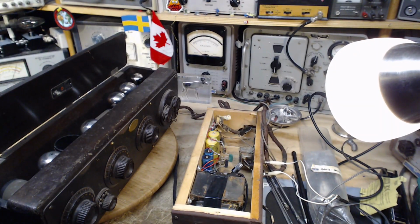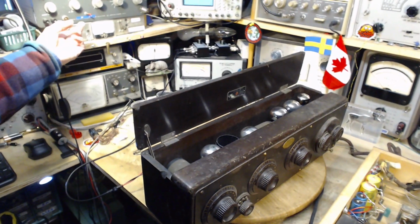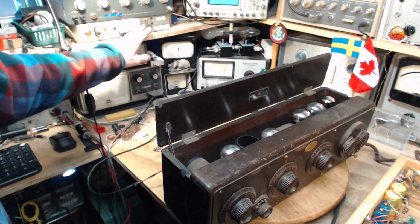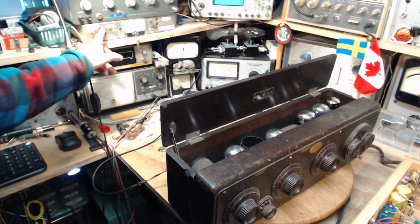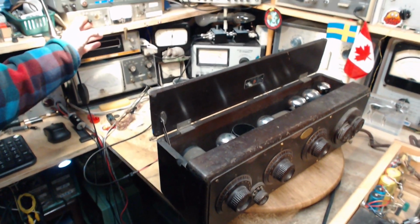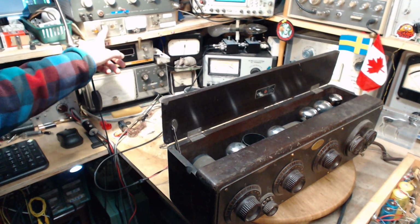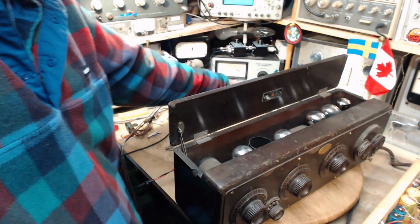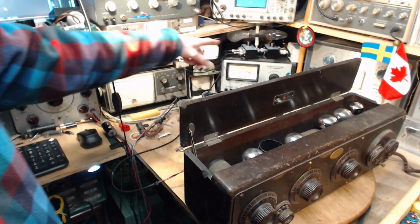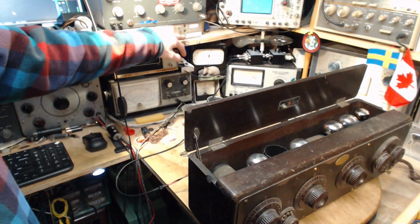Okay, so these switches on the panel here, with nothing plugged in, I'm going to operate them because they have a very characteristic sound. Hear that sound? So you hear that sound, you know I'm flipping one of these switches. This is the master switch, if you like, to just turn on this box. This box is nothing special, really. I had it, so that's why it's here. With this switch off right now, there can be no power here. I put the switch on. Now this switch selects whether the power will go through these light bulbs or go straight to the device under test. So normally I would throw this down.